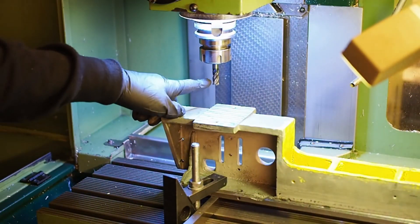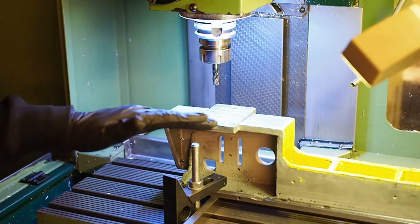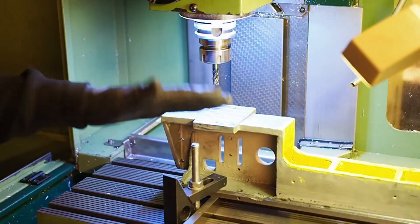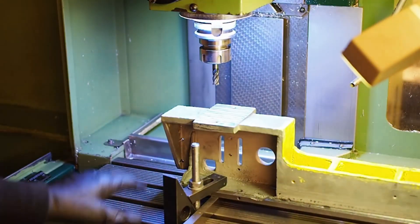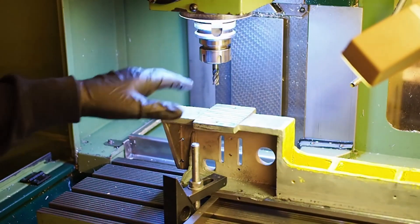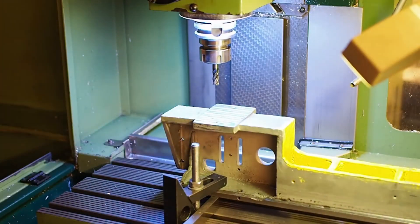You may wonder why I'm using such a small end mill — a 10mm. Basically by using a small end mill it takes away the tramming errors. So if I did one large pass with a large surface mill, if I had a slight tramming error, then I could get quite a major dishing in the surface. So this kind of minimises that.